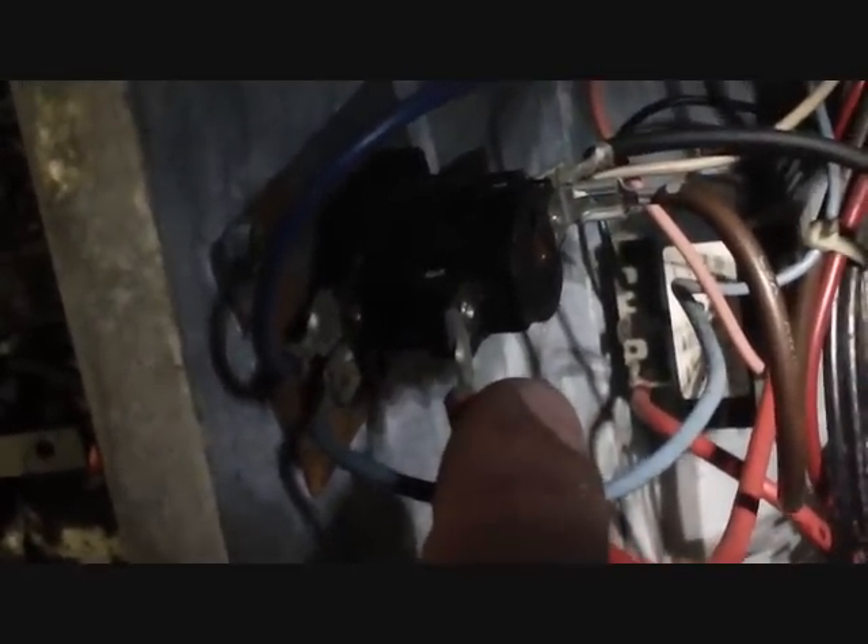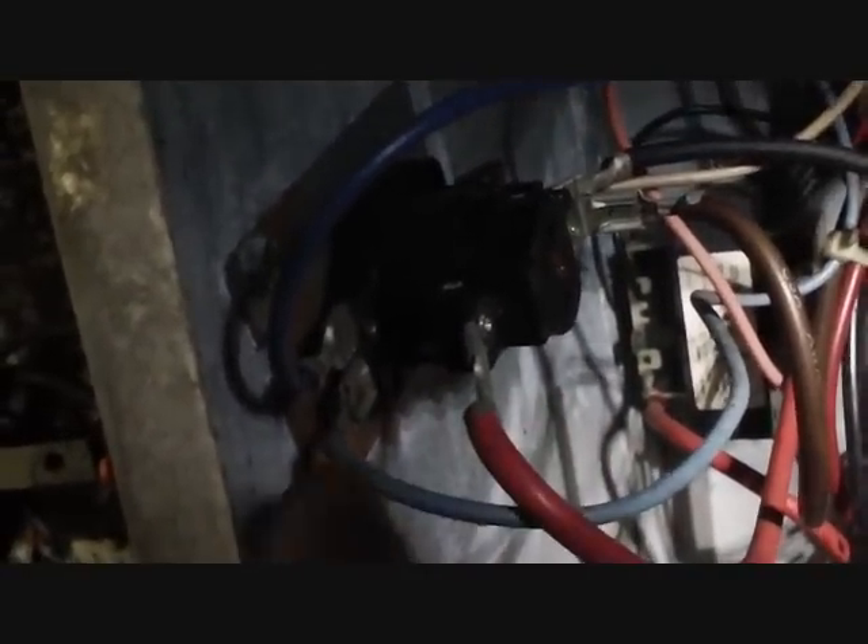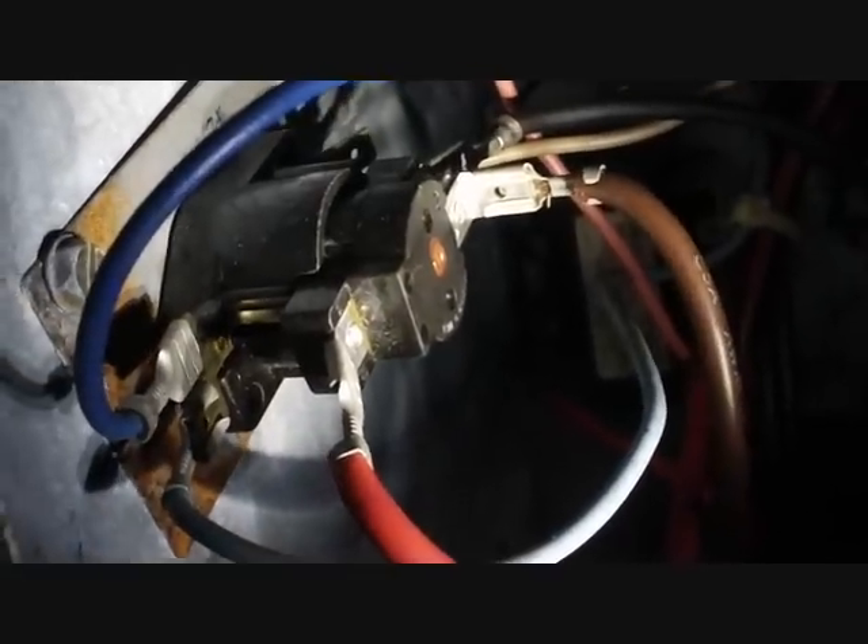The fan was calling — checking 24 volts to either side of this bottom area. You see these two blue wires coming in; on the other side is a white wire. These blue wires come in on the opposite side. This relay should have a resistance of around 70 ohms.